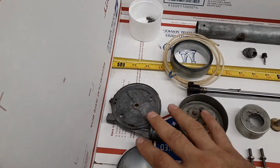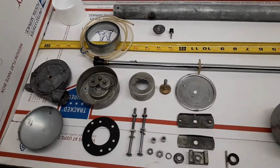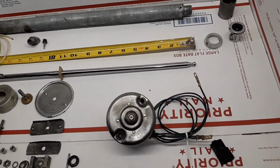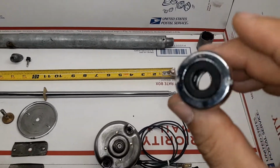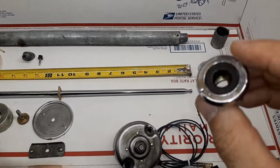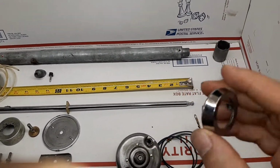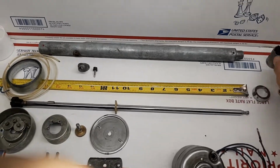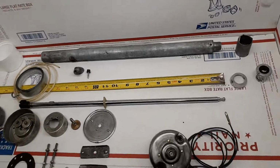as the drive box, cap, and winder body, and all of the actuation components and seal. The motor's been taken apart and fully rewound, and it has a beautiful chrome bezel that the telescopic mast protrudes through, as well as the mating ring that goes in between the chrome bezel and the fender, and the top body cap for the tubular mast body.